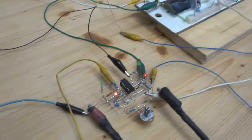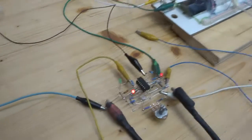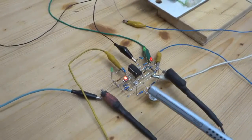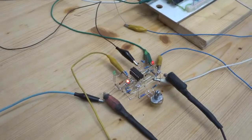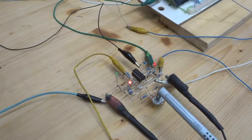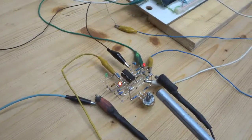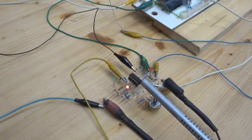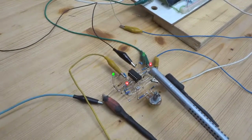Okay, here again my circuit, and I soldered up this monstrosity because I had a lot of problems with flaky contacts on my breadboard, because an operational amplifier has a very high gain. Okay, so here are my two LDRs again, one facing towards west and one facing towards east. Here is my adjusting pot so that I can make some fine adjustments if it is off a little bit. And notice what happened on the red LEDs. One is gradually fading out and one stays lit, so it shows me which LDR got more light than the other one.